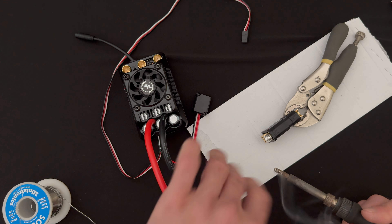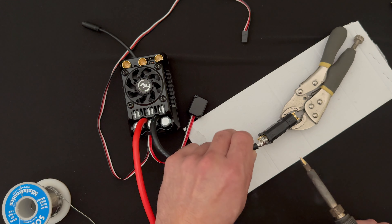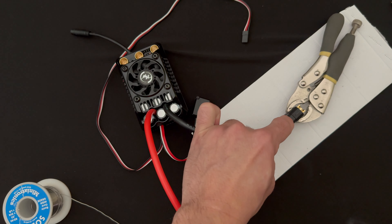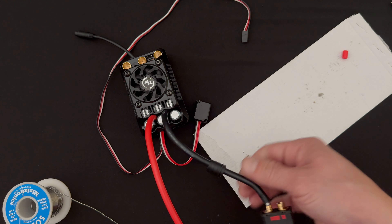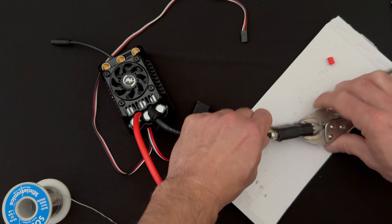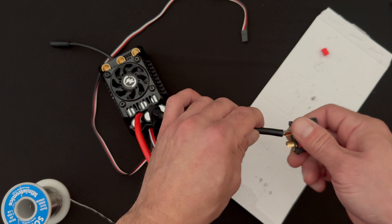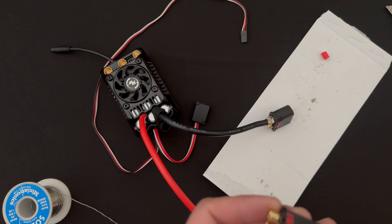Oh wait - I forgot the insulator. Now I have to unsolder that and put the insulator on. I'll flatten the wire just a little bit - that's another nice thing about having cardboard, you have a decent surface to mash wires around. Apply the heat, start with some solder, a little downward pressure and we're back. If it's a little exposed, pinch the insulation back and give it a little push forward to skinny it out. The extra plug is also there to stop you from melting or deforming the plastic.